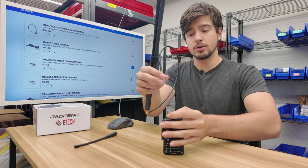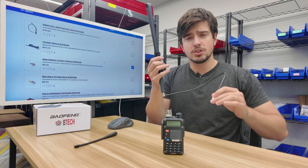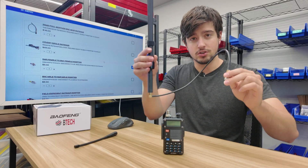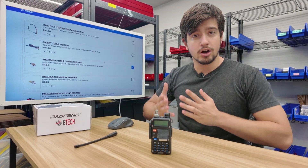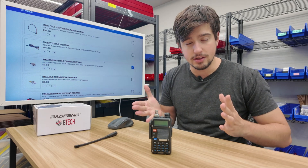What this adapter allows us to do is use BNC connector types, which is very important for swapping into a plate carrier because we get quick disconnects. As an example, I have a giant whip antenna connected to an antenna extender connected to another BNC adapter — imagine this antenna in your plate carrier. To put the radio in, all you do is pop it on, turn, and it's locked in. That's the really cool part about quick disconnect adapters for this kind of setup, but we still need an actual antenna.